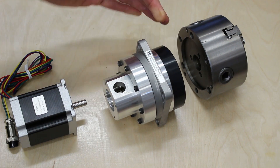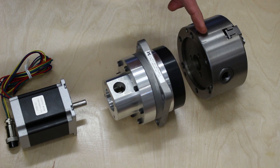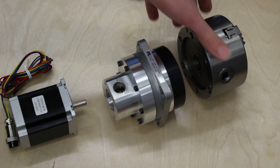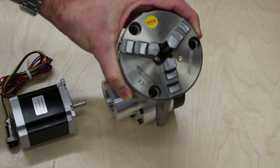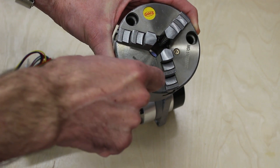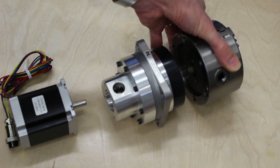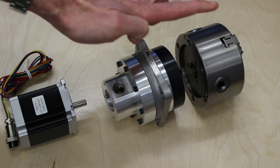The other piece I need to make is a faceplate to go on the front of the harmonic drive and mount this three-jaw chuck. This is a front-mounted chuck, which is a less common style but readily available. Front mounting means it has holes in the front so you can put bolts through from the front to mount into the faceplate, which is necessary because once the faceplate is attached to the harmonic drive I won't be able to put bolts through from the back.